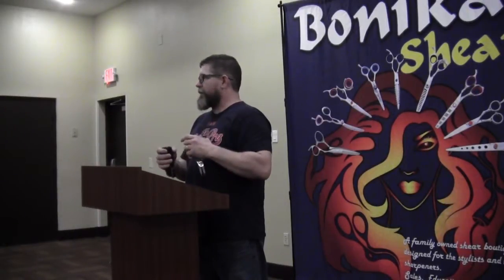And so we take our $3.99 snap ring pliers that we got at the hardware store. We go in, and you hear that noise? Yeah. Because the snap ring plier wasn't very good, and the snap ring pops open, and these are brittle, and then they crack. And so you come in to do a real quick cleanup job, and next thing you know, you're replacing the housing for your customer.